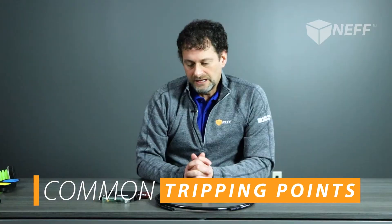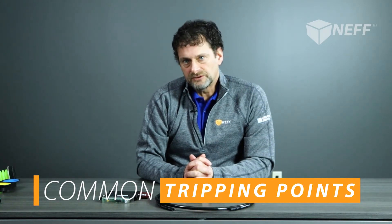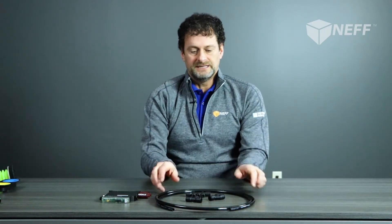Vacuum applications seem to be the most trouble spot I have with my customers, and there are a few tripping points they tend to fall on. I like to use the example of a milkshake — you're not going to drink your milkshake with a bar straw because you won't get any flow. What you want to do is use the largest straw possible to get as much flow as you can. Same thing with the tubing in your vacuum system: you want the largest ID tubing possible, and you don't want to wrap your tubing up in circles because you're restricting the flow. You want straight lines as much as possible, and use straight fittings rather than 90-degree fittings because those cause restrictions.